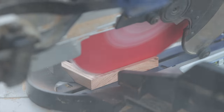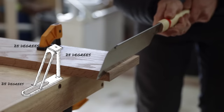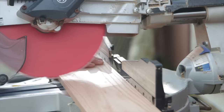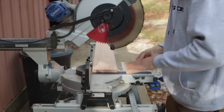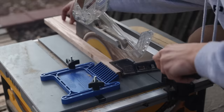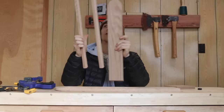What I'm doing here is cutting the lengths for each of the pieces. The only thing to remember is the front tire slot will get a 25-degree angle cut on both sides of it, and the top board will also get that same angle cut on the front side. For the back brace with power tools, I ripped down an extra piece so I could utilize a half-blind dovetail joint. For hand tools, we'll use a leftover piece from making the tire slot for the front board.